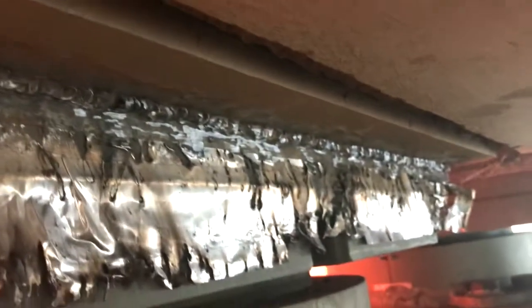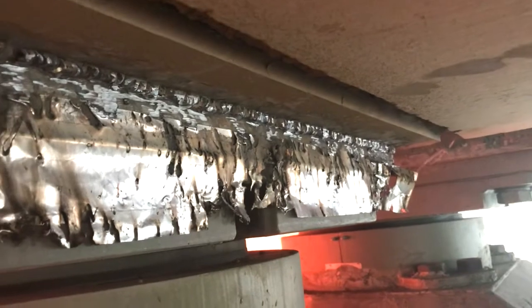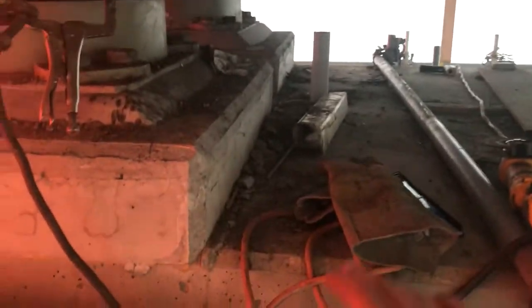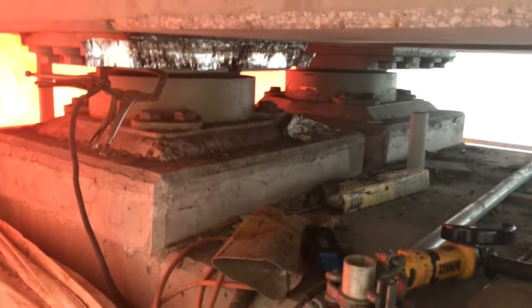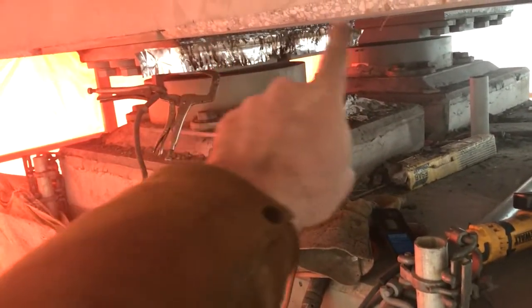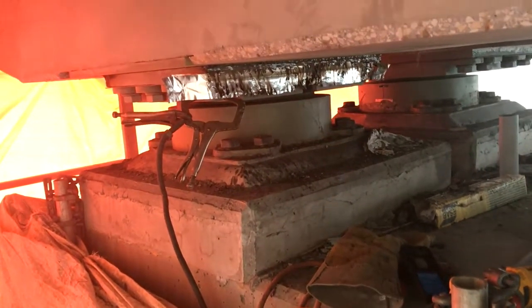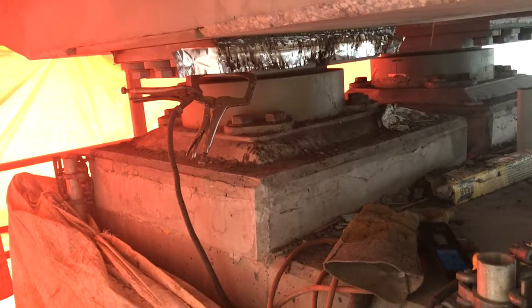That first pass, nothing too glamorous, just gotta get something in there to burn up that first layer of that green epoxy crap. So now, start crawling that hole, laying on my back or side or whatever, half in, half out, and just burn rod after rod for half an hour, hour and a half, I mean. Lay there for an hour and a half until the weld's done. Buffer off. Woo! Next one, next one, next one, next one.